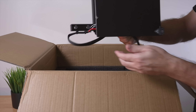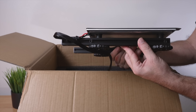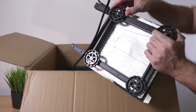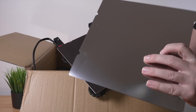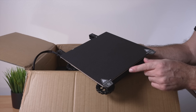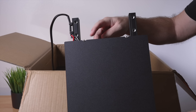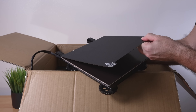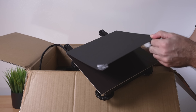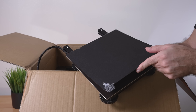The part beneath that was the bed, not the base — there's apparently one more layer and this box is quite deep. Here we have the bed, and it looks like most of the installation will have to do with the bed frame. It's pre-assembled with insulation on the bottom and large knobs. What's great is this flexible PC steel sheet — it magnetizes. Using this PC sheet on other printers like the Ender 3 S1, I really like it. There are also two little bolts that help you line up the sheet before you drop it down, so you can place it back in the same spot every time.